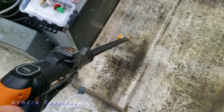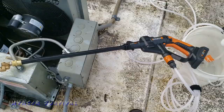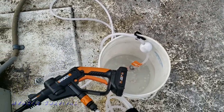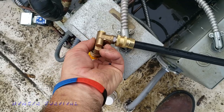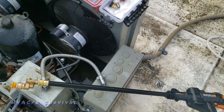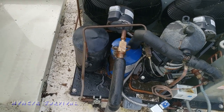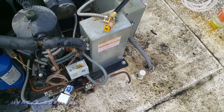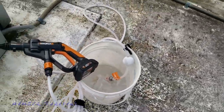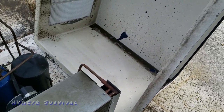I was able to get the coil cleaned up - they didn't have water nearby, so I used this flexible nozzle that gives me the ability to get into tight spots, along with some other nozzles. Thanks to Amazon - link in the description along with the tools I use. We went ahead and sprayed out the coil and degreased it with some yellow degreaser, good old Nu-Calgon. We got a lot of that crap out - the coil isn't near as bad as it was as far as the oil stains.